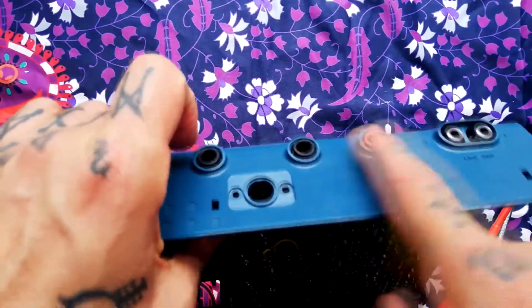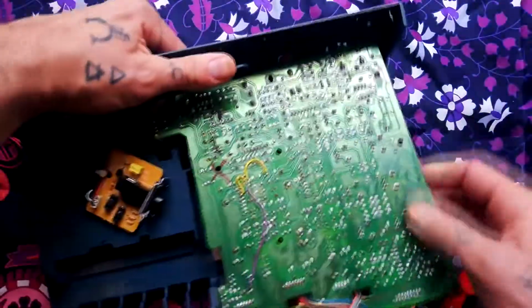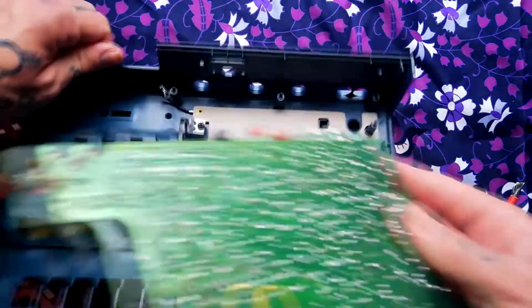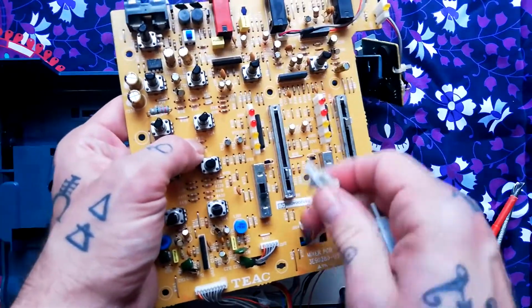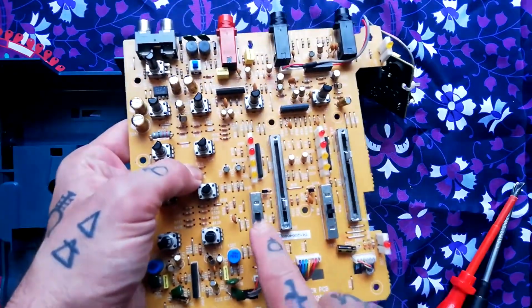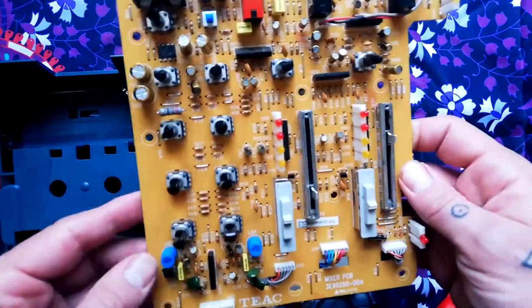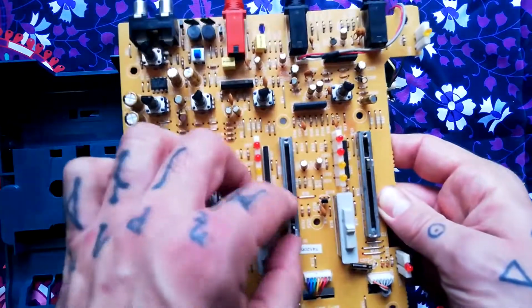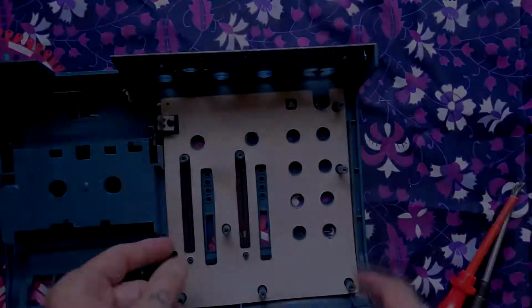Now, these sockets are mounted to the board, so you're going to have to tip it up this way so that these sockets come out of these holes. The board will look like that. You could remove those switch caps if you wanted to get in here to do a more thorough clean of those switches. In the description I will put some links to videos I've made about cleaning a mixer. It's demonstrated on another model of Tascam, but the principles are going to be the same.